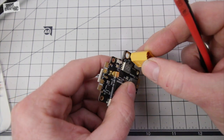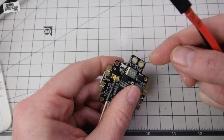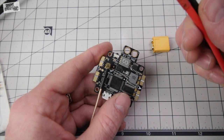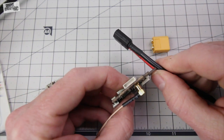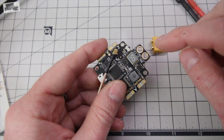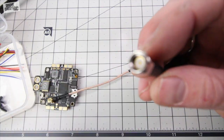Because in the past I've seen these actually break the PCB off of the flight controller — just break this in half in a bad crash. When those 4S batteries fly off they have a lot of force. So I would recommend just cutting one of these a little bit short, running it off the bottom like that and soldering it directly to this. Just use a liberal amount of solder on there. And you will need an antenna with this type of connector on here.